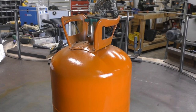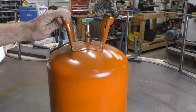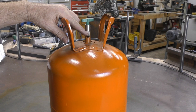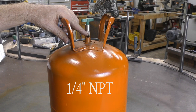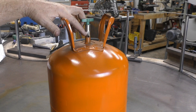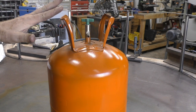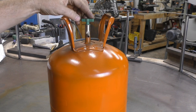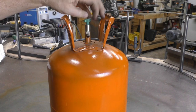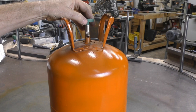You're going to need a tank — this is a freon tank — and whatever tank you decide to use, you're going to have to find the attachment that will take it from here to a 3/8 pipe thread. This is a flare fitting, and I'll include the link to all the fittings I use in this particular project, but you may have to make a few changes for yours. This is nice because it has a valve that will allow you to close off.